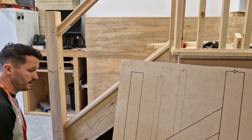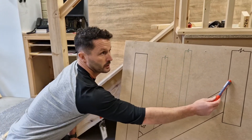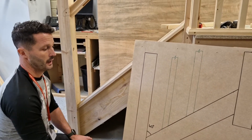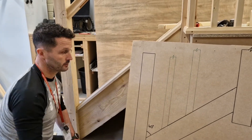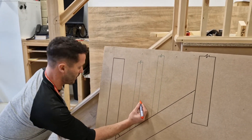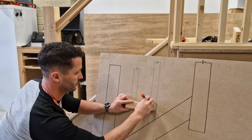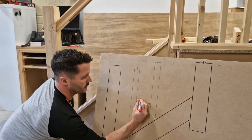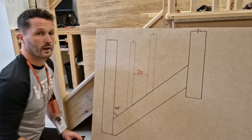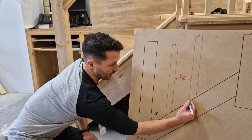So what we need to do next is — I've drawn out the newel post, I've drawn out the other newel post, and there's the string. We've created our angle at 40 degrees and now we need to work out our spindle dimensions. A few things we need to consider: we have to go a maximum — it's got to be 99mm maximum. We can't go any more than that. So then what we need to do is work out the angle of this.